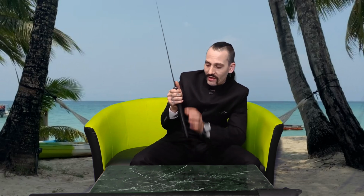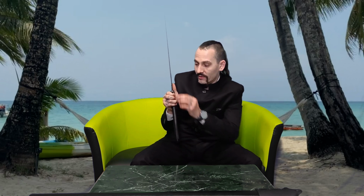On a real medieval sword, I have to say the handle is fully made of wood, and it's over a pretty much rat tail tang on most swords, even historical ones. You could almost call it a rat tail tang. It's not as thin, and it's a full tang included into the sword. It's not welded on with a keyhole or anything like that, so it's really fully into the blade. From the construction side it's very stable, but it also has some flex and some give to it. If you hit something hard, it does not provide that much shock.